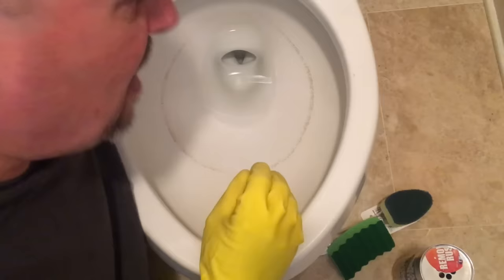If this is your customer, talk to your customer. Show them the pictures of the pitting and how you're treating it. But that the ring will probably come back. Now, toilet rings, remember, are more common during the hotter times of the year. Mold does not grow fast in cold weather or water. So most toilet ring complaints come during the summertime. And if you want to eliminate the problem, the customer can buy a new toilet or clean the toilet more frequently.